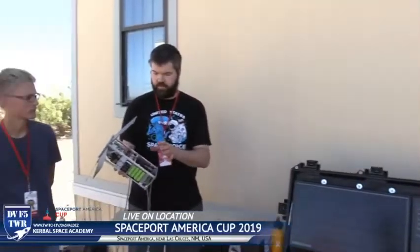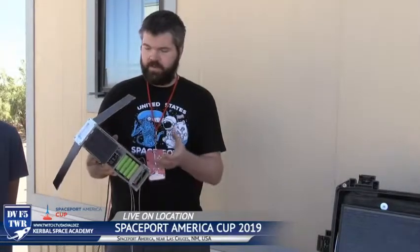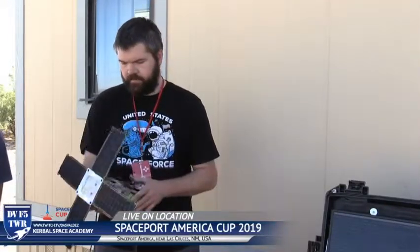Other than purchased components, everything is made in-house. The entire case and structure is machined by myself in the machine shop at Clark. All of the mounts for the motors and control boards are SLA-printed on our Formlabs Form 2 printer. This is the prototype with a lot of hours in it, but I have all the toolpath CNC files to machine the very accurate parts again. It's actually 20 microns off from 10 centimeters in both directions, so we could very easily duplicate this over and over.